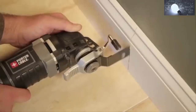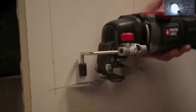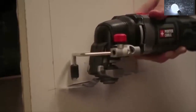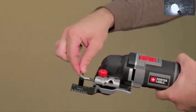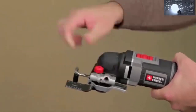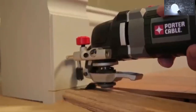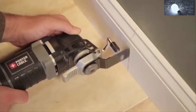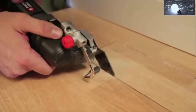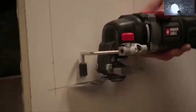A new depth and cutting guide accessory has two functions that help the user control the oscillating multi-tool to make more accurate cuts. In the depth position, the guide can be adjusted to only allow the blade to plunge to a certain depth of material, such as cutting baseboard while keeping the sheetrock intact on the other side. In addition to the depth position, this accessory can be used in the cutting position to help keep a straight and even line while making longer cuts in wood or sheetrock.